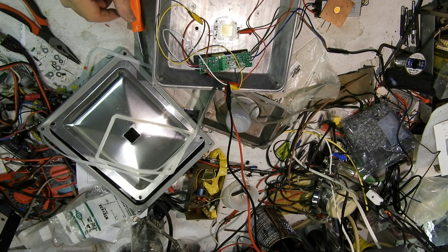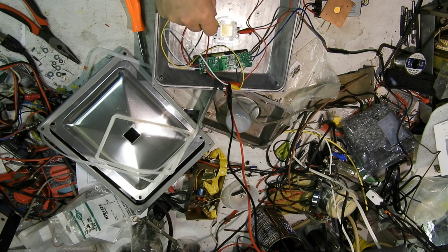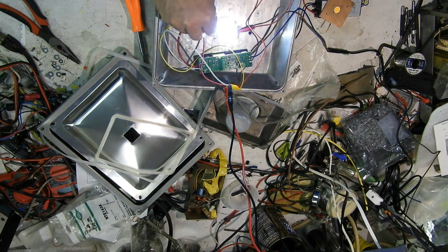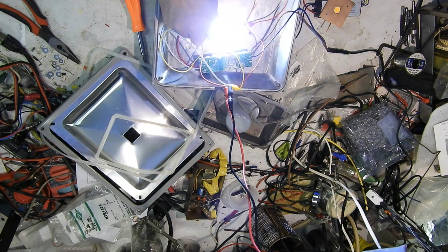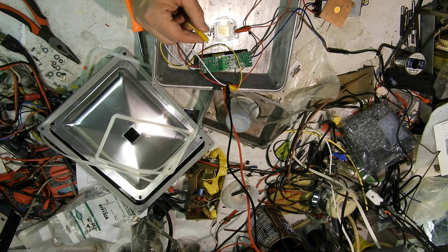So now my open circuit voltage on this regulator is 41 volts. I was getting like 47 on the other, closer to 42. But it flashes this LED the same way. Let's see if the voltage is going the same place. Yeah, same range. It goes down to 25, then up to 32 or so. The open circuit's about 41, 42.